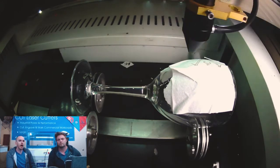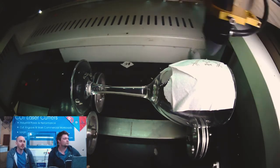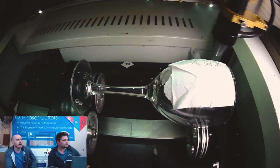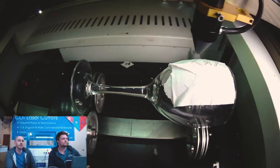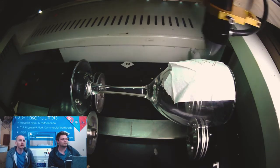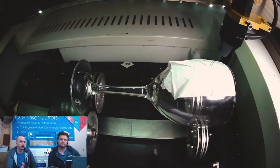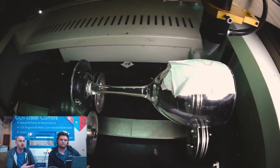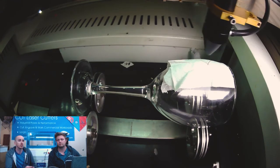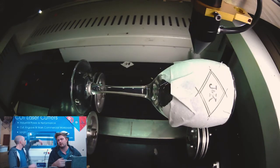As you can see, there's a little bit of smoke but not a lot of exhaust pull — we have those two things off as we're just etching glass. Really, the only smoke coming up is coming off the paper we have on there. This is actually a P-Series 90-watt — we're doing this on a P-24 90-watt tube, one of our favorite machines. It's the least expensive way to get into a 90-watt machine with a 24-by-16-inch table. You can pass through four-foot-by-two-foot pieces of material with the pass-through doors, and the motorized Z-table gives you eight inches of Z-room. When you take off the knife edge, you can throw in the rotary and have it rocking and rolling in just a moment's time. All that smoke is really just the tissue paper — if you were doing just glass, it would be nothing.